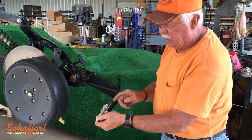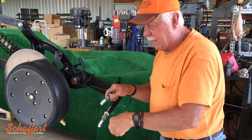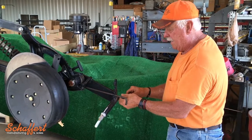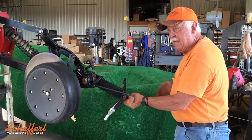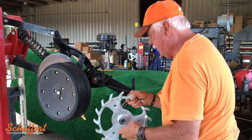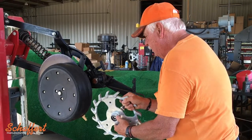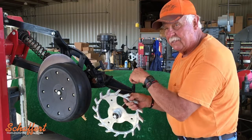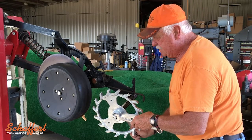On a left-hand unit, you have the punch mark up — it's coming out and bowing back. On a right-hand unit, use the opposite mark: screw it in on this side and bring the punch mark up so it's tilted out this way and back. That gives you your eccentric. If the farmer wants, he can put the quarter-inch bushing on the inside and the half-inch on the outside. Then take two 15/16 wrenches and snug it down and tighten her down.